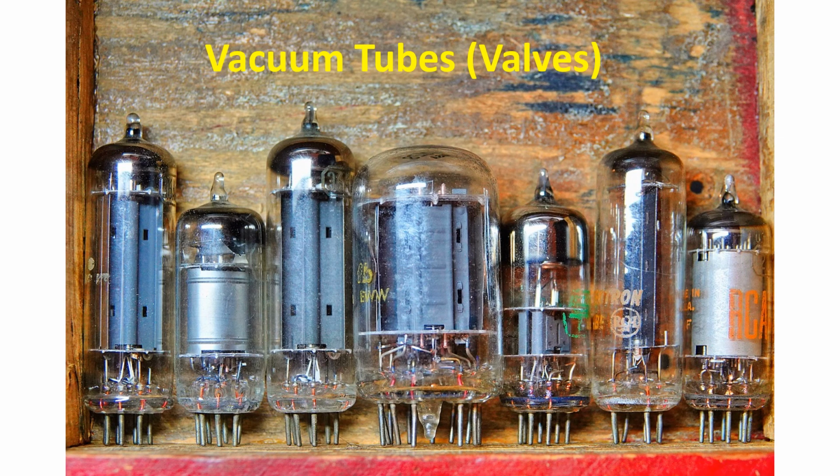I was using a vacuum tube self-assembled radio with output of about 120 watts fed into a horizontal dipole antenna tied on top of coconut trees, which were in plenty at my parents' home. For receiving, I was using our home Philips radio, which I had modified to cut off the input when the 120 watts output was going to the antenna using a simple relay mechanism. But we had only a short time period in the morning and evening when the signals would reach that far. At other times, I could contact Europe and other parts of Asia.